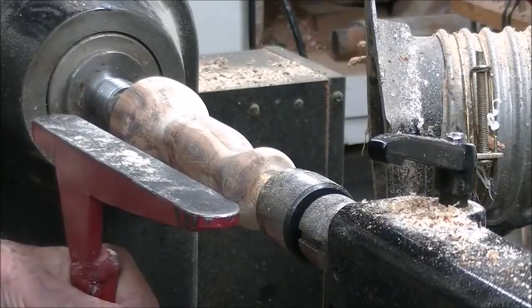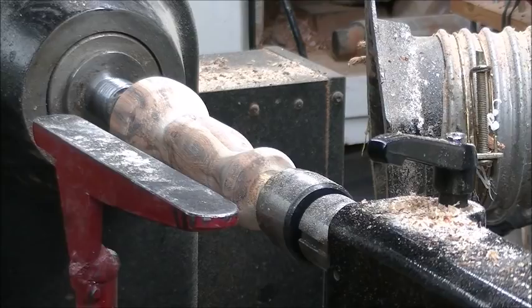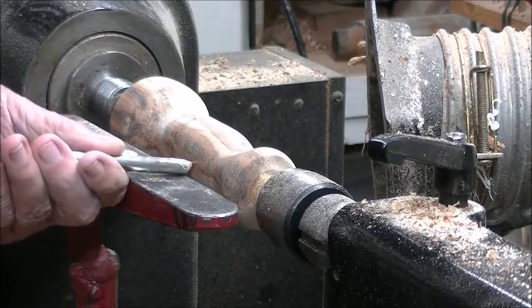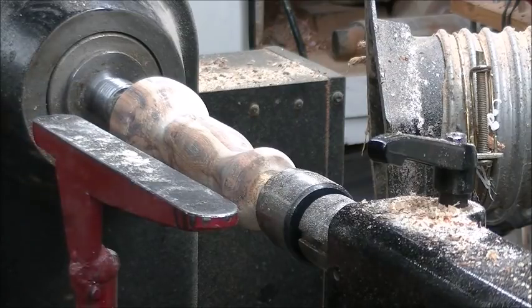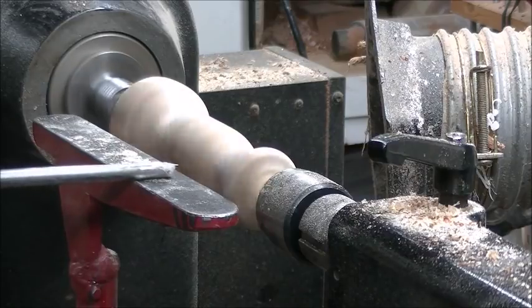These burn lines, you have got to have a groove to start with, and I always use a little quarter inch gouge to make them, just to make them really easy to do. Like 1, 2, 3, and then probably 2 there. Nothing there, I don't think. So let's see what we got here. Maybe I'll do 4. Yeah, that'll work.